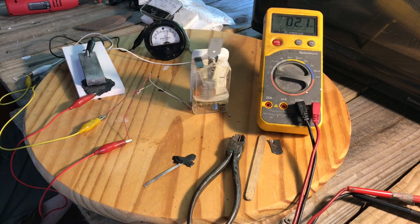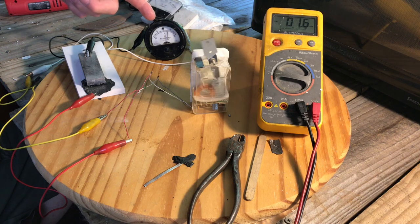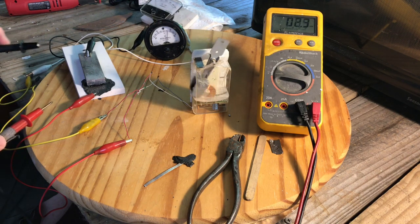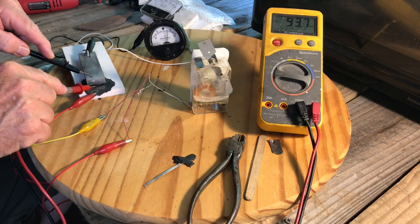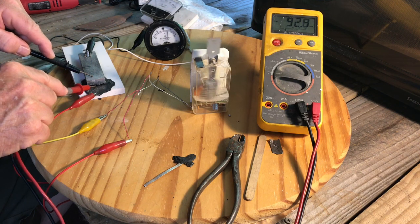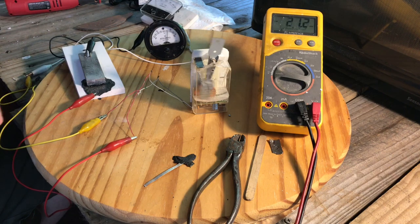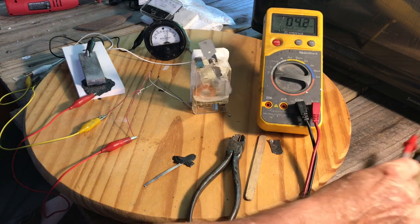As you can see, this thing is running really well — it's evidently charging up the capacitor pretty well. The draw is around 28 to 30 micro amps. On a draw like that, I'm only seeing about 88 millivolts, which has dropped from about 1.5 volts down to that, but it is continuing to charge up and go to town. That's not too bad.